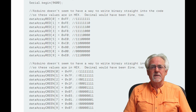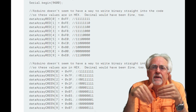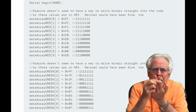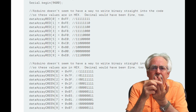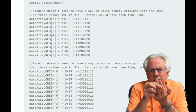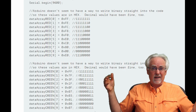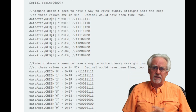Well, you need numbers. If we said an off switch was a 0 and an on switch was a 1, then we could have two numbers, a 0 and a 1. Well, that's not very useful. But if I had two switches, off-off would be 0, 0, that would be 0. Off-on would be 0, 1, that would be a 1. If I had 1, 0, I could say that's a 2. And then on-on would be 1, 1, that would be a 3. So if I start stacking these on-off switches together, I can get bigger and bigger numbers. And since I can have, in effect, an infinite number of on-off switches, I can represent any number by a series of zeros and ones.